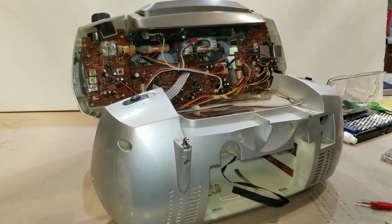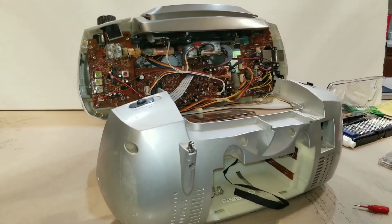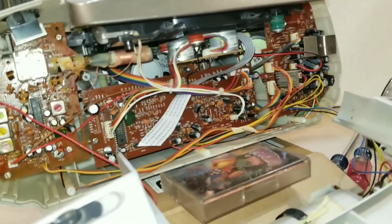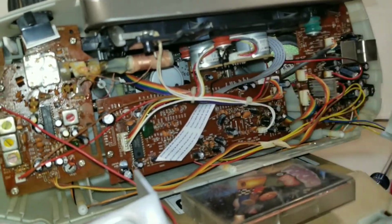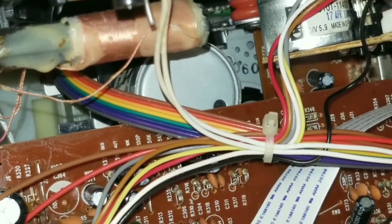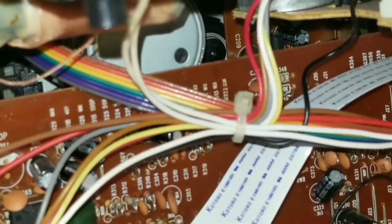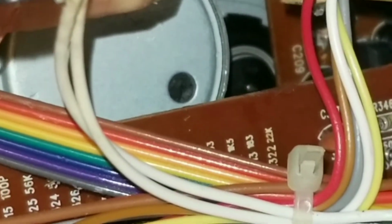Sometimes there is a little hole that you could slide a real thin screwdriver in and actually do this without taking it apart. But on this one, we're going to take it apart. We're going to take this screwdriver now, and I'm going to want you to see something. Up here, there's some motors, right? But that's for the CD. We're looking in the back, and I'm going to zoom in a little bit so you could see. Right back there, that silver circle, that's the motor. All right, and on there's a little black button if you see it. That black button is what you're looking for.